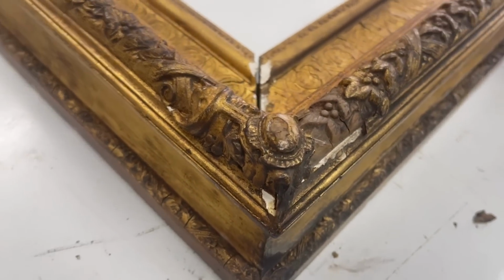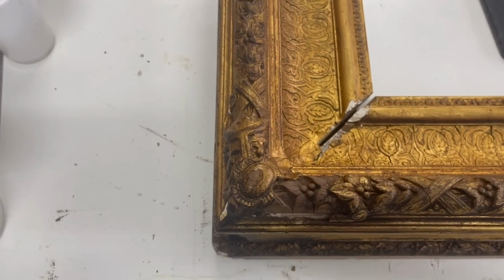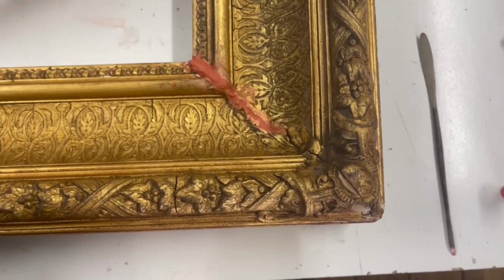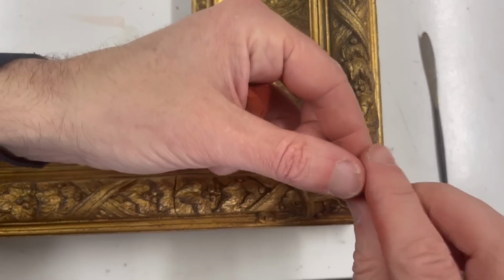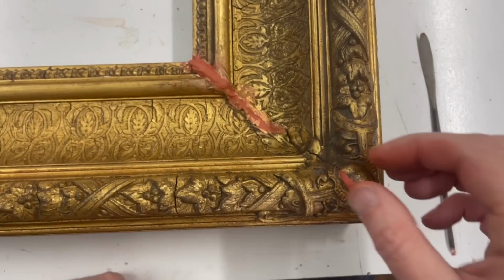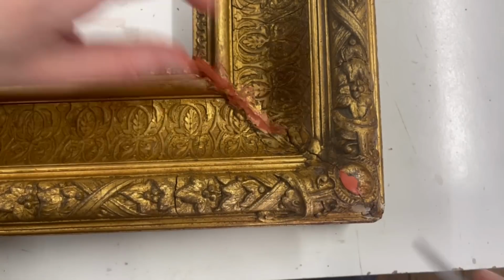And then I'll recreate that other side with a clay or a putty, just to replace that missing section. So again, attaching loose pieces down here at the bottom rail. And then you can see this bit here is where I've actually filled in with some clay, just replacing those missing sections that don't actually justify making a mould. Sometimes it's quicker to actually just make them out of the clay and carve them to match rather than casting